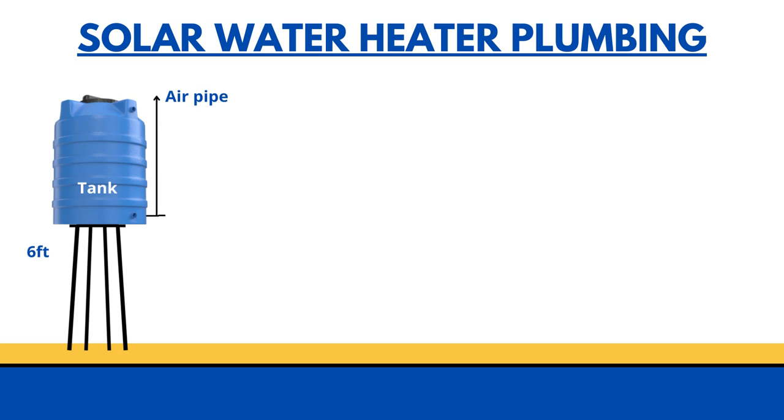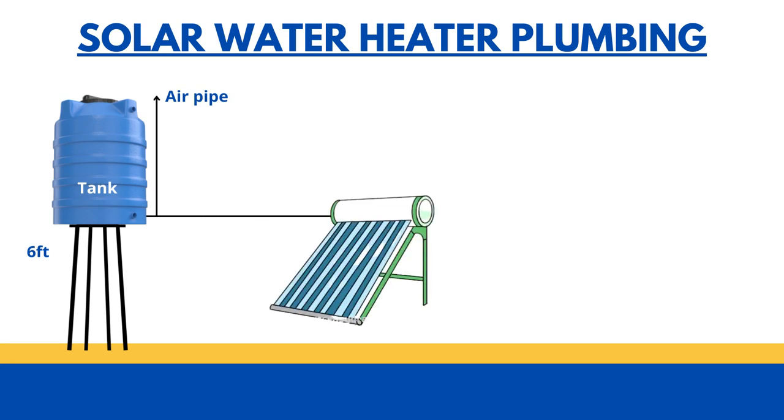The air pipe helps in releasing the pressure created within the tank. Below or next to the air pipe, a pipe should be connected to the solar water heater inlet. Between those connections, three elements should be placed. First is the ball valve — it helps with regulating water flow, meaning you can control the water flow by turning it off or on. Ball valve is a better version of a gate valve to open and close the flow of water to the solar water heater. Next is the union valve, which helps with handling the flowing pressure of water. Then the NRV valve should be fixed — NRV helps in controlling the flow of water in one direction, preventing hot water from flowing back toward the cold water supply.